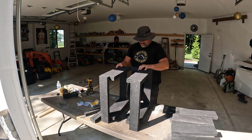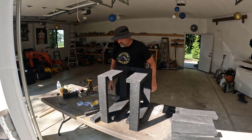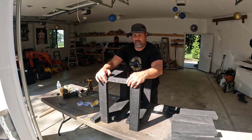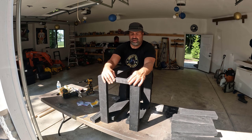Slide in here like this. Obviously it looks like I'm gonna have to cut down that middle board right there because one of these ain't gonna fit. So then this piece goes here like this too. What I'll do is I'll screw into here. I'll probably put liquid nails in that too because that's a pretty sensitive joint. I'm making sure I use the rounded part on the outside. I think it'll look better.